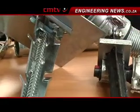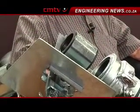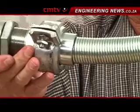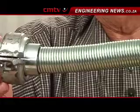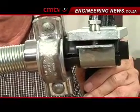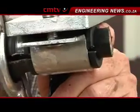When installed, we can accommodate the earth wire which runs along the cable. It's attached to the cable with cable ties, and then passes through clamps which are anchored into the ground. All the fasteners are of the shear nut type, which means once the nut has been fastened, tightened, and snapped off, you cannot remove the bolt. So the system becomes a permanent installation.